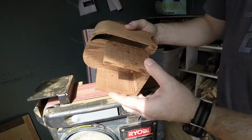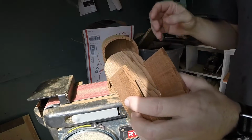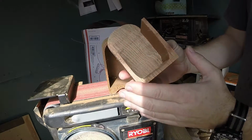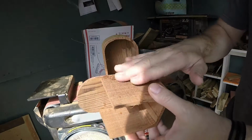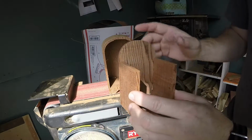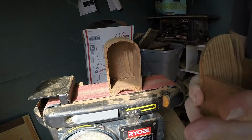then we'll make some sands on the drawer itself to get it to slide in and out easily. So we're gonna sand the back, the sides. We're gonna round the edges all over. It doesn't have to fit in tight. It just has to fit in there because we're gonna glue it to the front and it's gonna slide in and out easy.